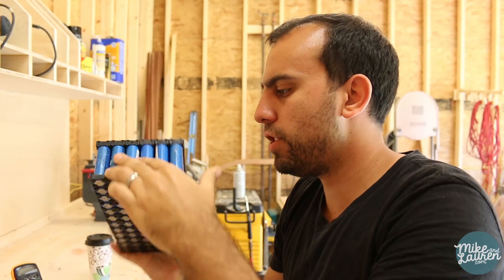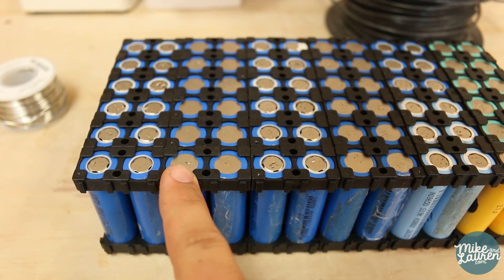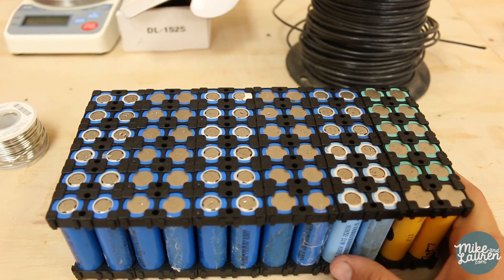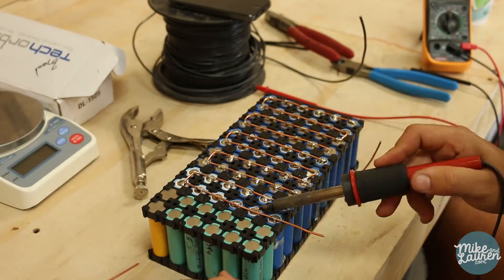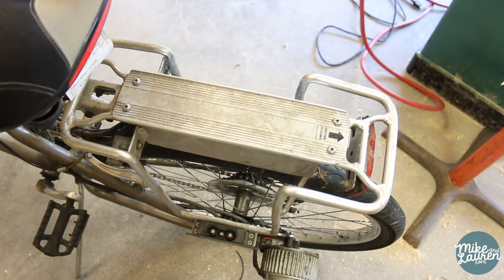My battery is put together. Now I just need to connect all the cells together — I'm going to use solid core wire and solder all these batteries together instead of tweaking my spot welder. The positives of these 12 cells face one way, and the next 12 are flipped so the negative side connects them in parallel, and then I run these in series. Credit for this wiring design goes to Rinoa Super Genius — I've watched all his videos and that's where I've learned everything about electric bike batteries, so go check his channel out. Here it is all finished up — we are hoping for 24 volts or more. Ready? 24.4 — perfect! So I'm going to build a quick-and-dirty little box for it to put on the back of the bike, test it out, and if it works we'll make something more permanent.